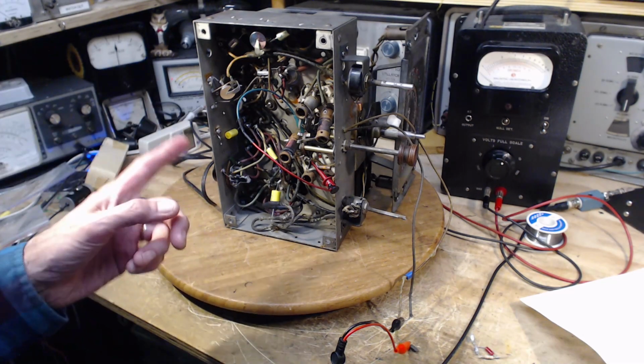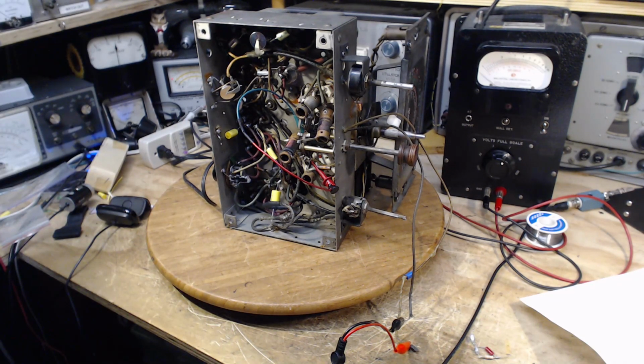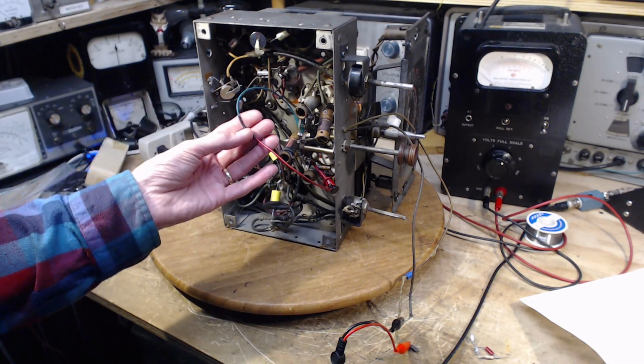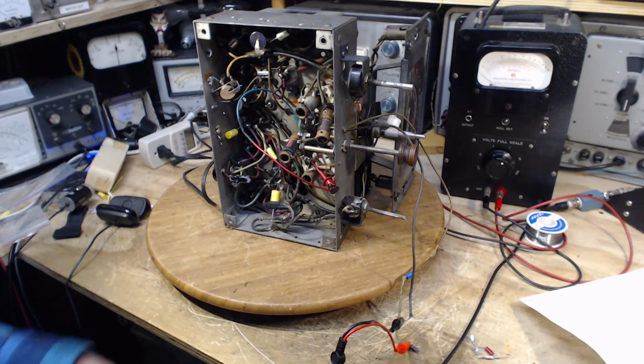The next step is we'll look at the schematic, consider the situation, and then do some testing and experimentation to try to determine what the best resolution is. Maybe a wire isn't the best thing. Maybe a capacitor connecting these two points together would be better. I don't know. We'll have to just fool around and try to figure this out as we go, to get the best performance possible in a radio that has a burned out coil. So let's go look at the schematic here.